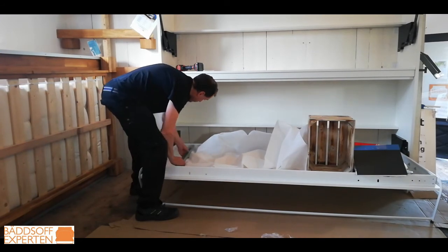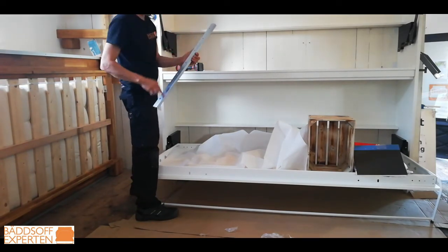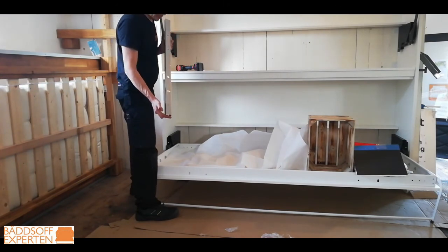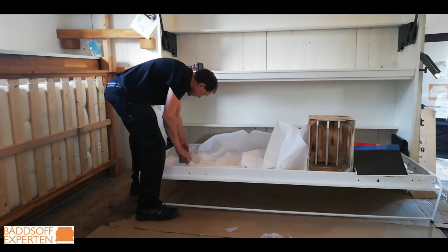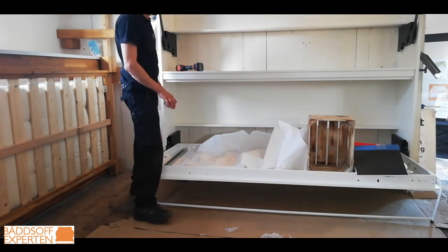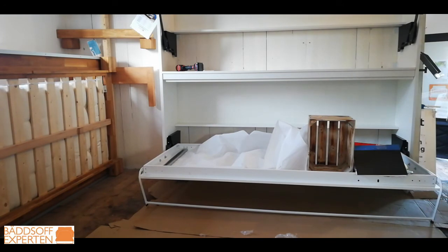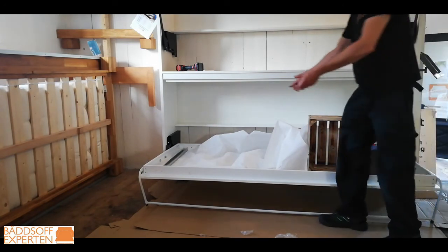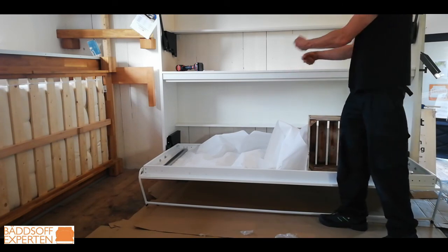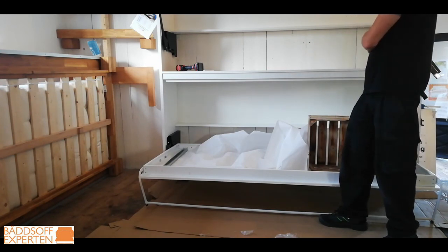Then you put this in the back. As you see, it has holes all the way, and you should use the same small screws that you used to fasten the metal frames in the bottom of the front of the wall bed. Just put it inside like that, then screw it together. You fasten it on one side, and when you come to the next side, if you have problems doing it yourself, use a friendly helper. You need to pull the fiber texture really strong so you get it tightened over the wooden slats.